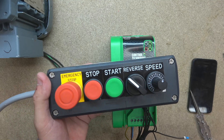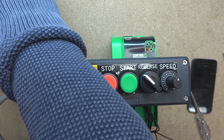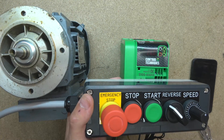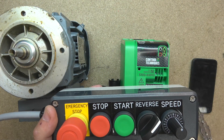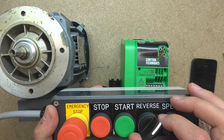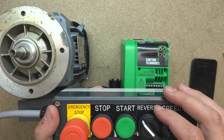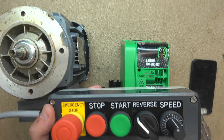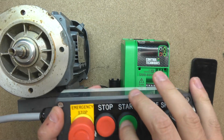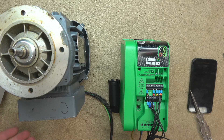There we are — there's our station. Let's check it. It started, our motor is spinning. By clicking reverse, as long as it stays on it will go into reverse. Our potentiometer is right in here and it goes into reverse automatically. To stop it, use the stop button, and obviously when we have e-stop engaged, nothing will work. That, ladies and gentlemen, will do for this video.